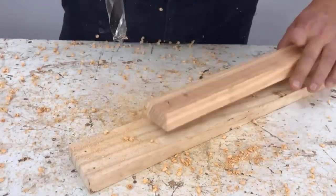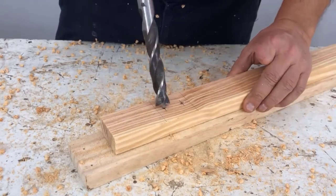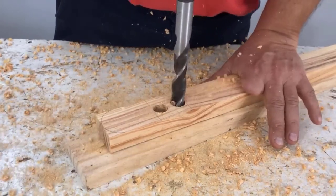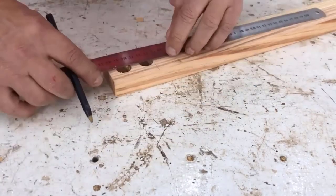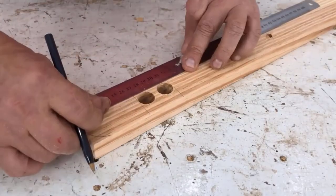Here we will use a 20 millimeter (2 centimeter) diameter three-point drill bit. It aligns perfectly with the edge of the width of the cross piece. We mark this as the top cross piece, and this will be the box that we will open with the jigsaw.